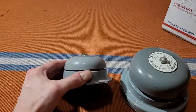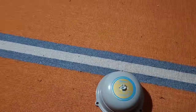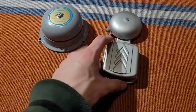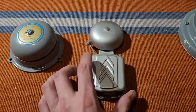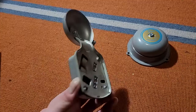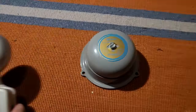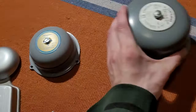From a side profile view you can see the resemblance very clearly to the larger models. Now, this is not Edwards' first miniature bell model that they made. They also have ones that look like this — this is the model 740 new bell. These are kind of a more old-fashioned type bell with the mechanism down here and the gong mounted separately with a hammer that goes up and strikes it. A version of this is still made today, although it's polished chrome instead of this brushed finish. This is a very old one from the 60s or 70s. The gong is slightly larger on the monitor bell than on the new bell — the new bell is about a two-and-a-half-inch gong, and that one's a three-inch gong. So you've got two-and-a-half inch, three inch, and four inch.